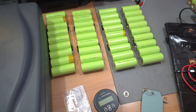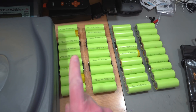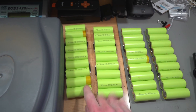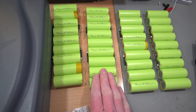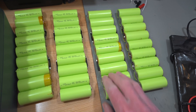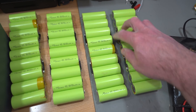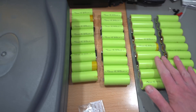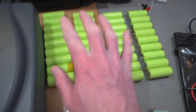That means we could potentially have loads of stuff running in here without worrying too much. I've got my battery heater on at the moment to take the edge off — it's pretty chilly, was about zero degrees today. I've got some Kapton tape coming to tape up the edges of the battery. Kapton tape is a heat-proof insulating tape used in batteries to protect connections from heat and prevent anything bad happening with exposed contacts. The balancing board should turn up today, then I can rig that on and start testing.